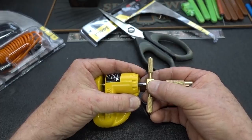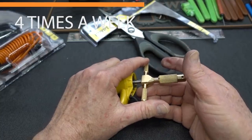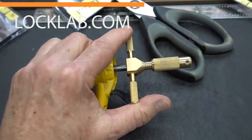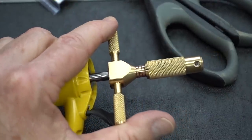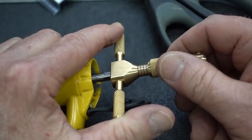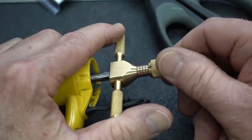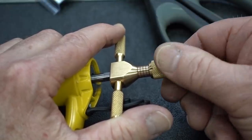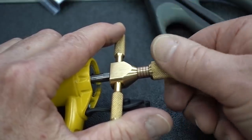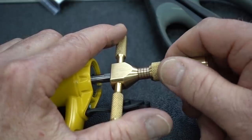Then I'll rotate it and get some tension, and I'm going to pull it out just to make sure I've only got one disc — the top one — and that is it right there. Don't want to try to tension on two discs; that would not be so successful. Applying some heavy tension and starting to bring it back out. I am looking for a binder — there's a binder right there. Letting off a little tension, and I think we just hit a gate.